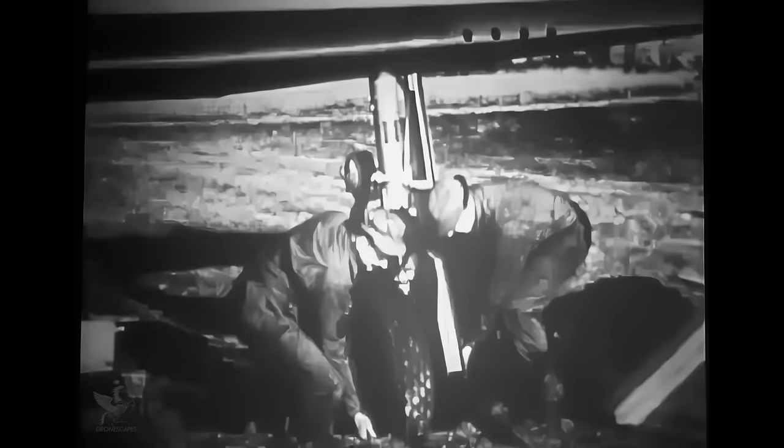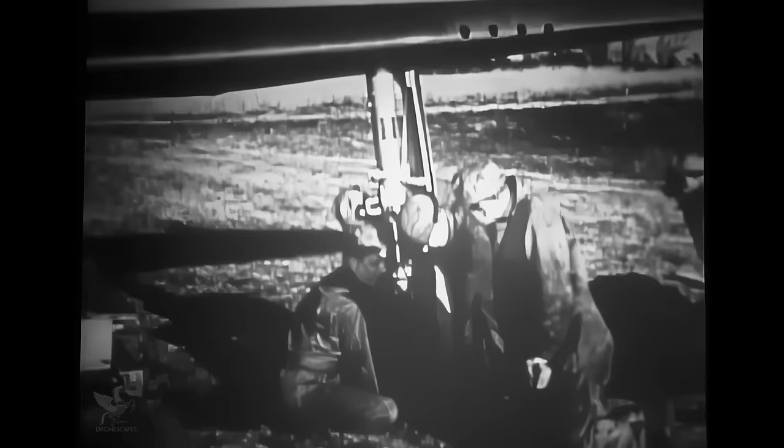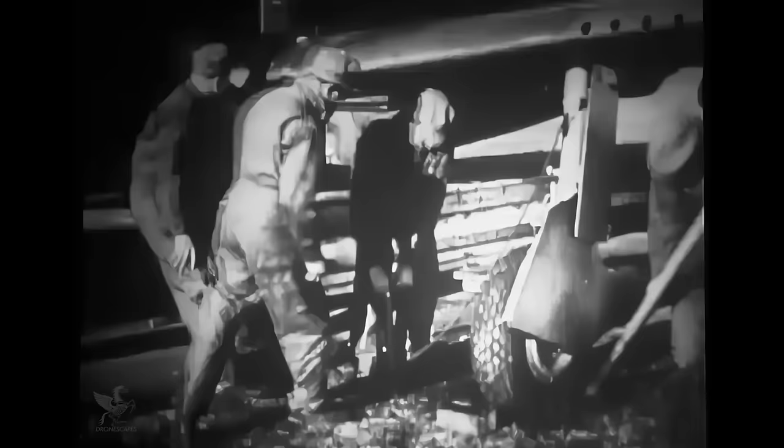First, the air must be released from the lower chambers of the shock struts. The landing gear must be fully compressed and held in this position while the pits are almost completely filled in and the earth packed hard under the wheel. Now the man in the cockpit should park the brakes. The entire plane is then jacked up by pumping air into the lower chambers of the shock strut.